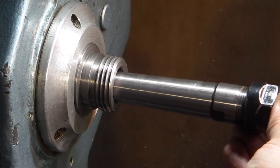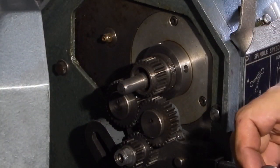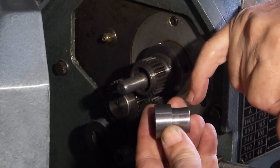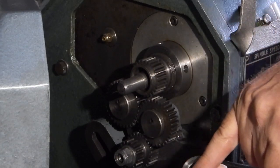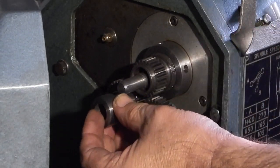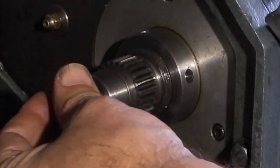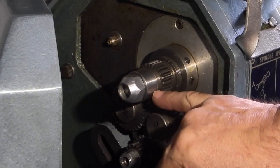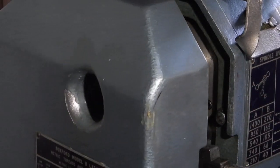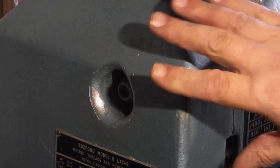I've already cleaned the taper, this is the rod coming through the headstock and onto that I'll fit a bush. This bush just fits into the bore — this gives the nut something to tighten up on — and the nut goes on the outside. I've made it so that the length that this sticks out I can still close the door. I have to on this machine because it's got an interlock on there — if this back door is open the machine won't start.